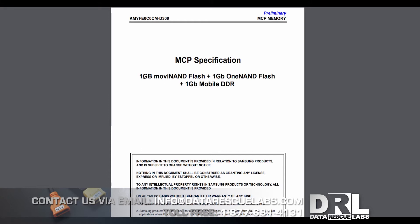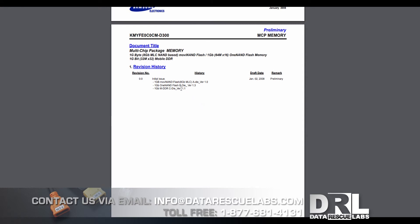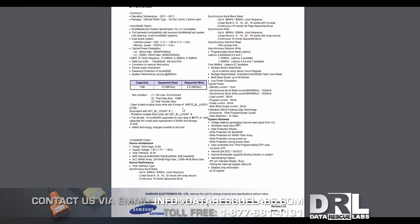Here's the chip — it looks somewhat different from what we're used to. This is not an eMMC; this is an eMCP — specifically a moviNAND, a very old-school type of chip. I found the MCP-specific specifications: this is one gigabyte of storage, 120 megabytes of OneNAND storage, and another 120 megabytes of RAM. What we really care about is the OneNAND, which is where the data is stored for the BlackBerry specifically.